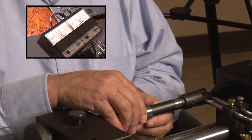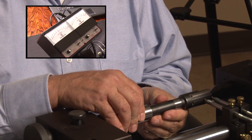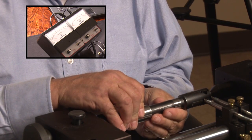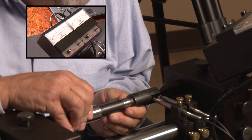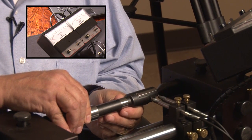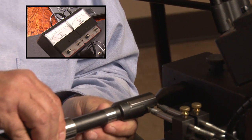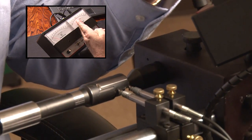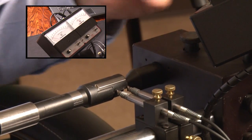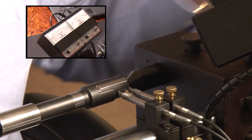Make sure we have that same consistency in the pads. Now when we come around to the blade, you'll see that we just barely are picking up a reading on there. We see our back taper just slightly below our pad diameter and the front is about eight tenths below.